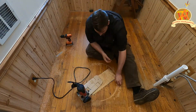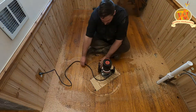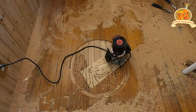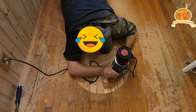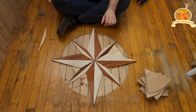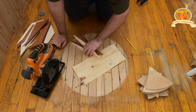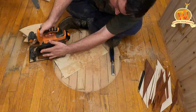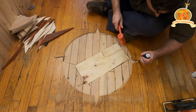We made our own jig to cut a circle on the floor — we recorded a video of making this jig which should be out in the future. After scoring the line around the outside edges I went ahead and manually moved the router back and forth cutting into the floor. They really need to make floors hip-high; Tim's too big for this job. I placed the pieces together and found true north, then traced out the peaks that exceed the circle. Then I set the depth for my circular saw. Tim made small passes with the circular saw between the traced lines, and after taking the bulk of the material out with the saw I went over everything with a chisel.